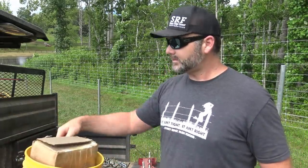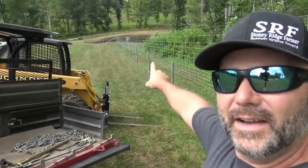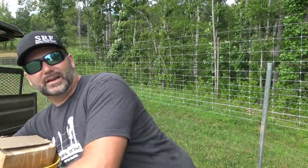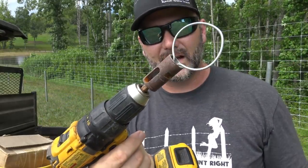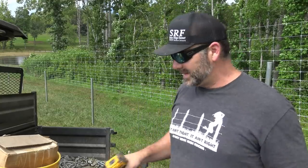Each one of these posts all the way down the line will have ties on it. This is a post tie for our two inch line post. I have a special bit on a little Dewalt drill — it's designed to take this tie, fit it in around the post, hold steady and twist. It'll twist until the ends right here break off. Pretty innovative little design. All this stuff came from Farm Fence Solutions out in Worthington, Indiana — I'll post a link in the video description. And this is our farm fencing shirt: if it ain't tight, it ain't right. And that fence is tight, man.